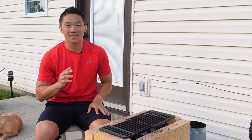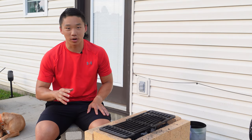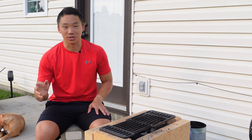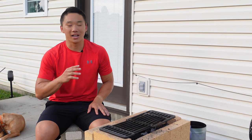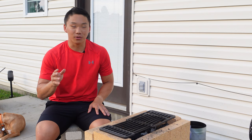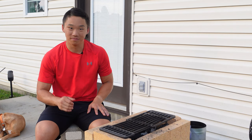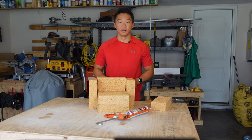Don't forget to allow the mortar to cure for a day or two in the sun before using. Third, the frame I built is custom and I know not everyone watching this will have access to welding equipment or the skills to do so. If you reach out to a local metal shop, this will likely be a fairly inexpensive job and will look a lot better than mine in the end. Fourth, if you don't build a frame but are using mortar to hold it together, a few clamps or even a ratchet strap will help to further secure it while it cures.